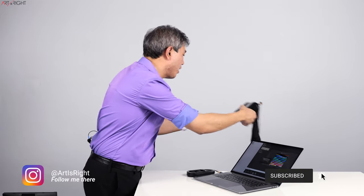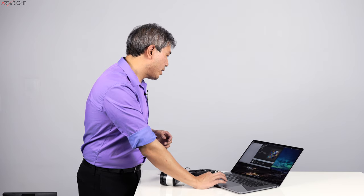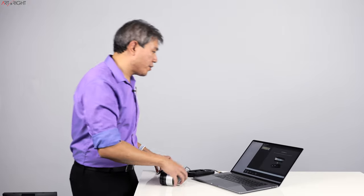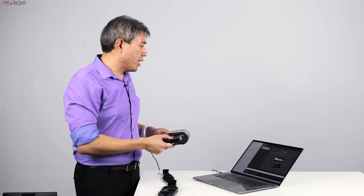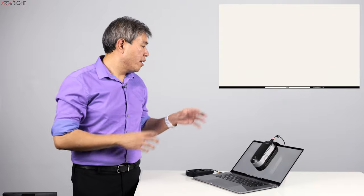That did take quite some time — this is normal for a color spectrophotometer to take longer than a colorimeter for screen measurement. Now that we have the result, we're going to save the value and do a quick QA using a color checker classic. But first I need to re-run the custom calibration on the white tile again. While we wait, I'll also be using this i1 Photo Pro 3 Plus to calibrate two other displays — the BenQ PD3220U design display with software-only calibration — then comparing the result to a colorimeter.